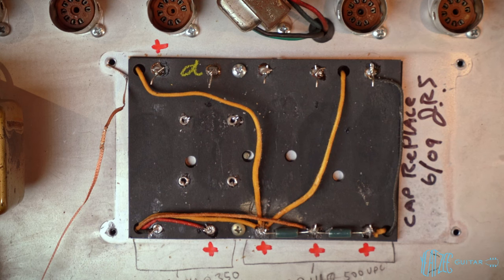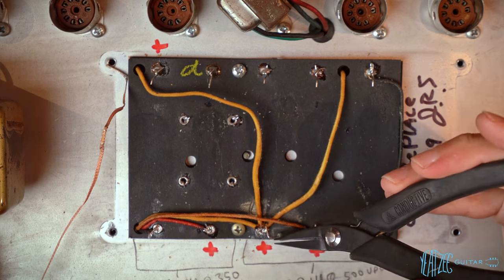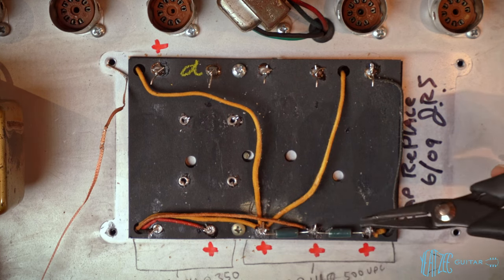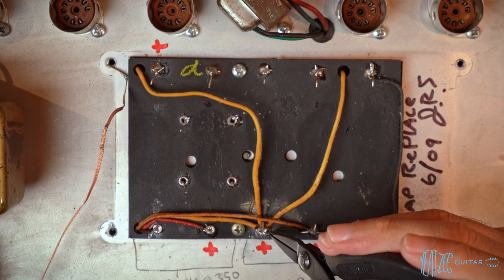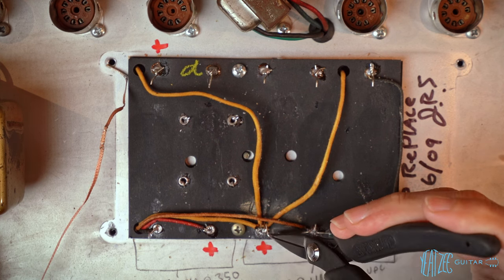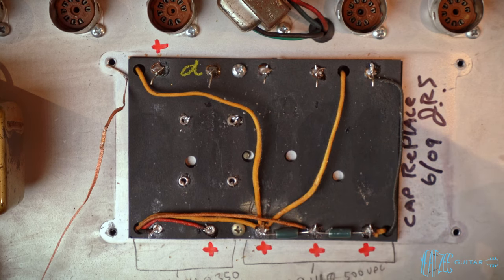Wow, look at this discovery. This resistor wasn't even soldered into the eyelet. It was literally just resting on top, like that. Holy cow. That's insane. Imagine not just putting it through the eyelet and just leaving it resting like that. That's crazy. What a mess.